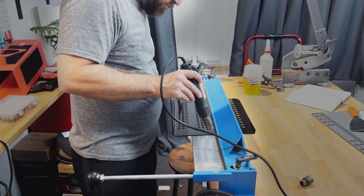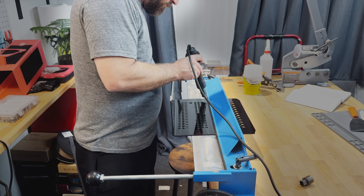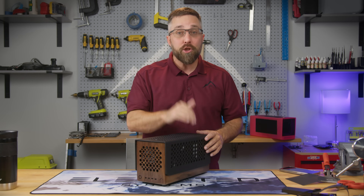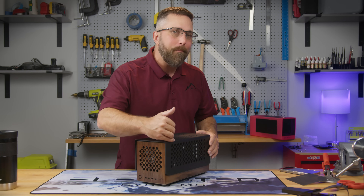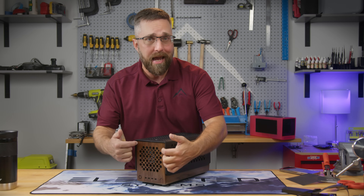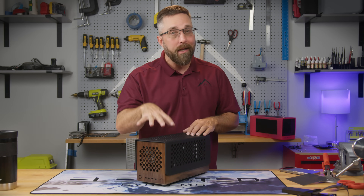I always shape cast acrylic using hot air — I've never had much luck with hot wire or infrared heaters, and you've really got to shell out over $500 for a good one. I wouldn't typically use my metal brake to bend acrylic unless I planned on sanding and painting the part, which is exactly what I did here — and it actually worked great, giving me a straight, tight bend. Unfortunately, the score marks I made were intended for the center of the bend, but I lined them up on the outside. Three-millimeter acrylic has a 3mm bend diameter, so my panel ended up about 1.5mm too wide on each side. It's not the end of the world, but it's not quite up to my standard, so I will be cutting a new piece of acrylic.